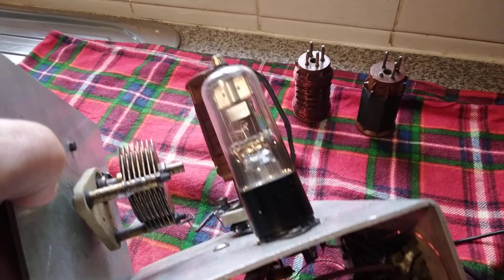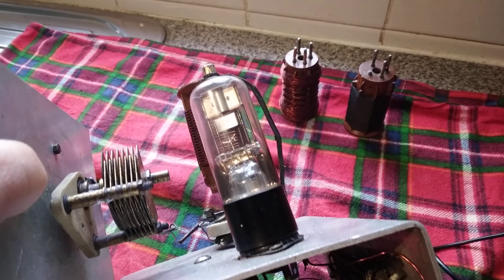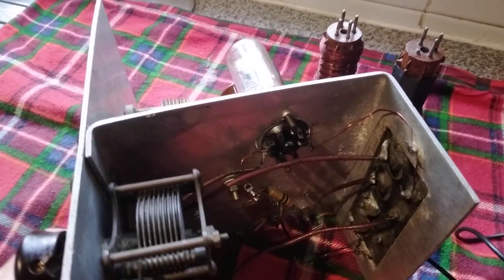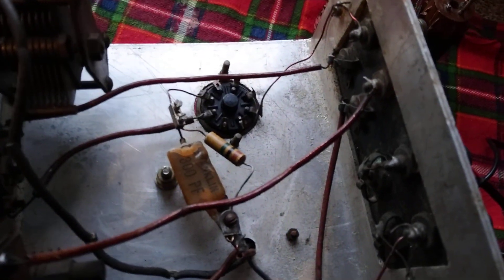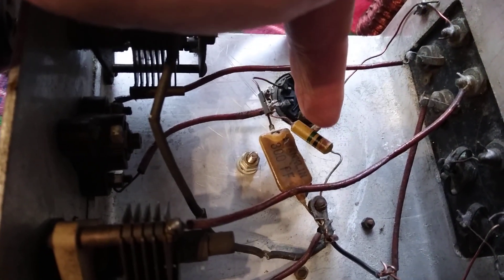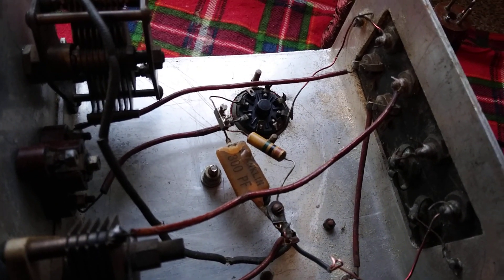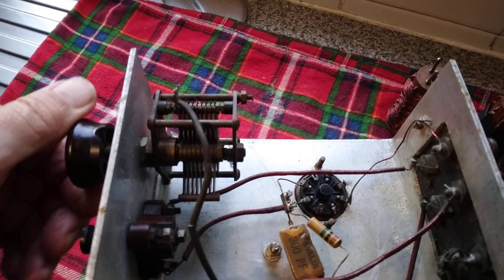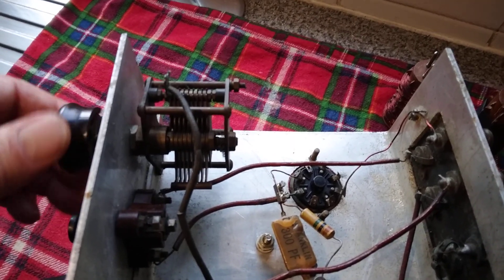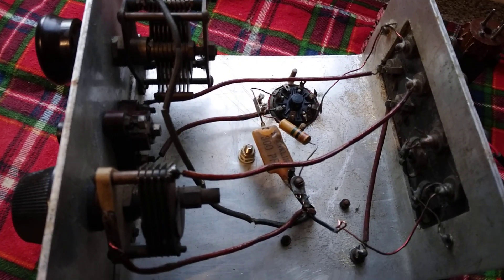Turn it over in the light — you can actually see at the top there you've got the grid and the filament connections. If you look at the base, there's a 1 megohm resistor there — brown, black, green — and a 300 picofarad capacitor acting as a grid leak, and that connects to the grid of the valve base. Then you've got your filament connections, and that variable condenser there is your reaction control, which feeds a little bit of signal back to the aerial, which then goes back to the valve and it reciprocates and magnifies the signal about three times.